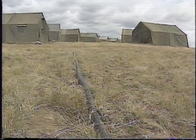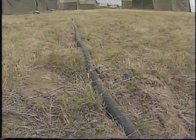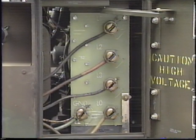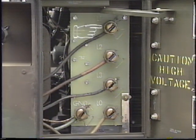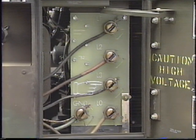In semi-permanent locations that have a large electrical load, a single large cable with four or five conductors is normally connected to the generator as follows: the neutral conductor is white and is connected to the terminal lug labeled L0; the ground is green and is connected to the ground lug; the black wire is connected to L1; the red wire is connected to L2; and the last wire — usually either black, red, or blue — is connected to L3.